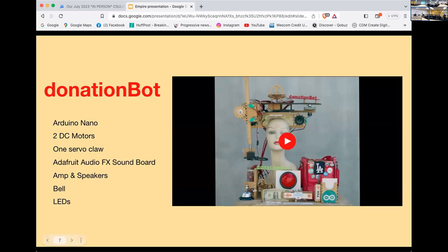Oh, that's cool. I was doing WAV files just from a single pin of a Nano. But you just don't have enough memory to store your WAV files. Yeah, even this is really not enough memory if you want a lot of files. And it's not that cheap. It's like $25. That's why I wanted to do it with a pin on the Nano. It's $30, and there's one that comes with an amp included, and one where you need a separate amp.